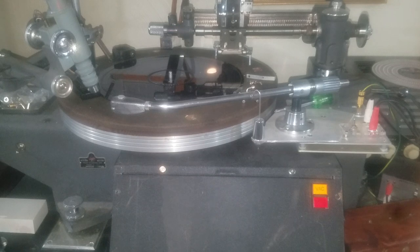I was advised by a member of Lathe Trolls to do this and I think it's a good idea. We're going to start with some smaller fuses at the 250 milliamp rating and work up from there. I'm going to be feeding it from a tube amp that has a considerable amount of power to it. I already tested the Webster but I didn't do it in a way I think was beneficial — I heard audio but it was very quiet through the head.